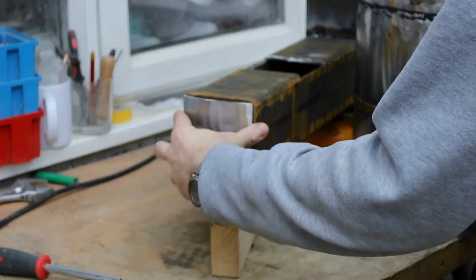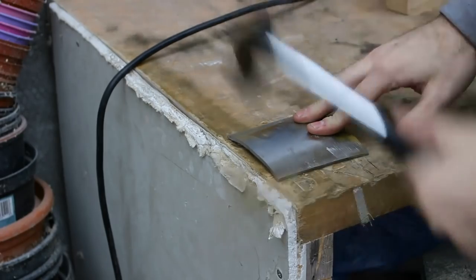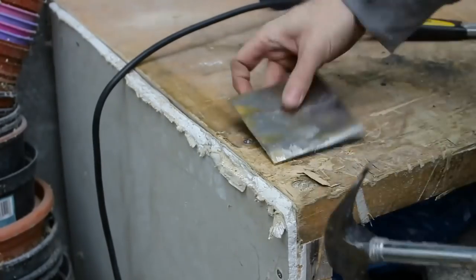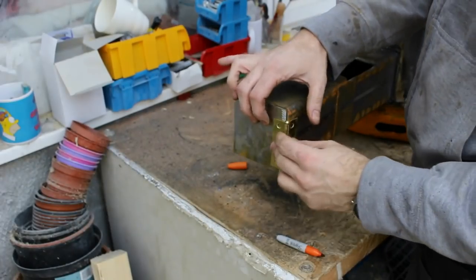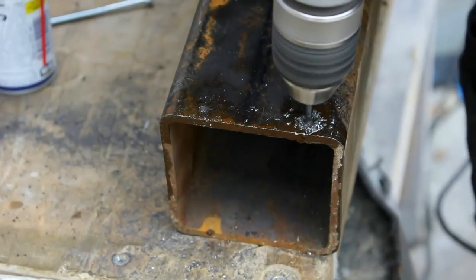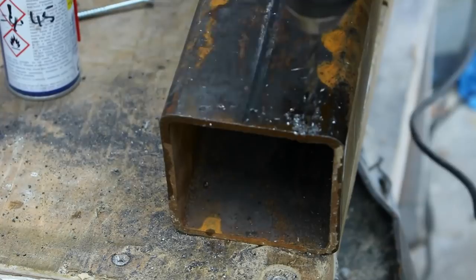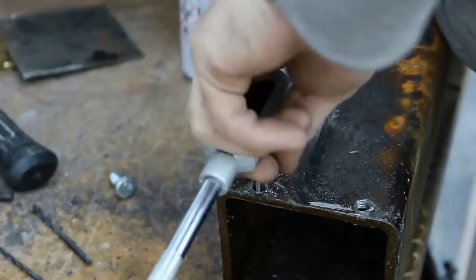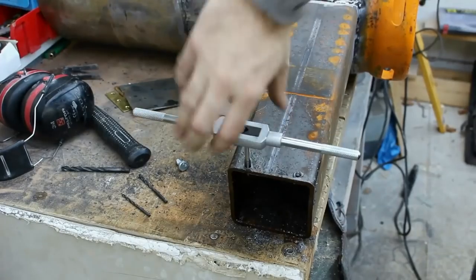Using the square of metal I cut from the front of the cylinder I made a door, although it was slightly curved so I had to hammer it straight. I did this a few times quickly and then realised I should use something else instead of my fingers to hold it down. Nice and flat, I put the hinge up to the side and marked where the holes have to go. I used a 3mm drill bit first to drill a smaller pilot hole and then moved on to the 8mm bit, using a bit of oil while drilling to try and make the drill bit last longer. With the holes drilled I used the tap and die to thread the hole — I could have used a nut and bolt but this is just much neater and it's quite enjoyable to do.